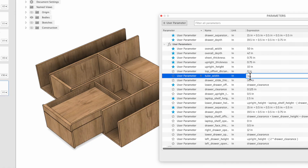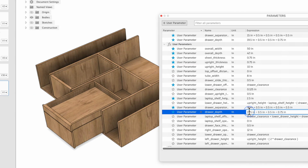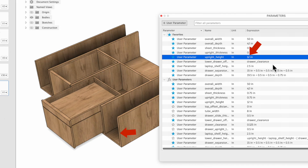The idea was promising — I had the mechanism, now I just had to build the storage unit. I used Fusion 360's parametric design feature for the design of the unit. This helped me map out the various storage cubbies and drawers without necessarily finalizing any dimensions until I saw how it all came together. With parametric design in Fusion 360, you assign variables to all your dimensions, and when you change those variables the design reformats accordingly. Unless your design is super simple, parametric design is the only way to go — it's flexible, robust, and actually makes the design process easier. I'll link to the Fusion design below; you're welcome to use it, but downloader beware: it's not meant as a professional set of plans, and some dimensions were tweaked in the final cart build.